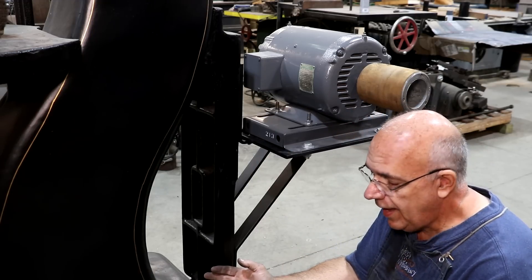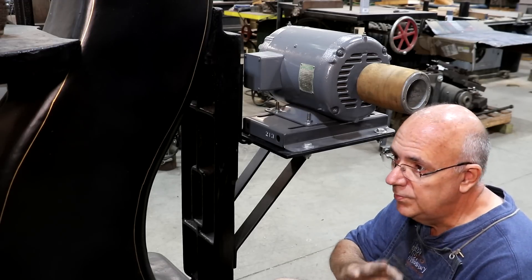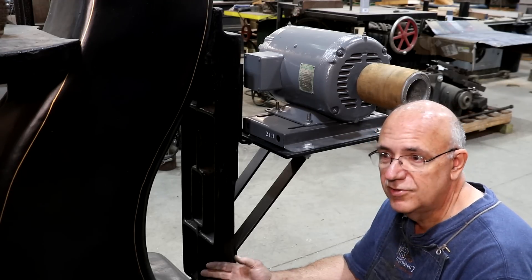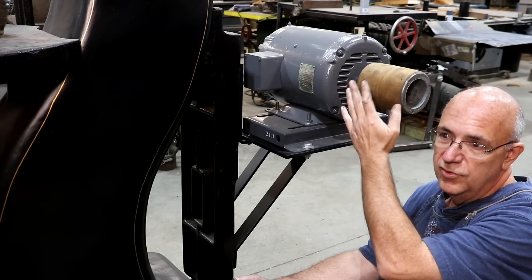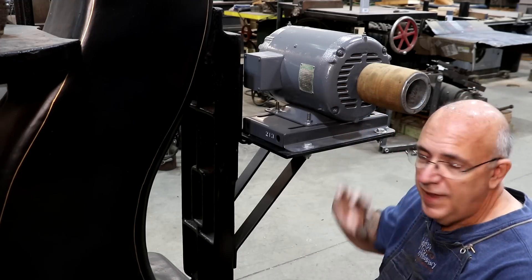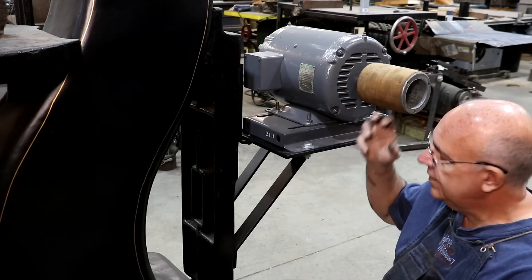To have a properly sized breaker for this, we would need to feed it with probably a 30-amp breaker. A 20-amp breaker would be too low because we need 22 amps. I don't think they make a 25-amp breaker, so probably a 30-amp breaker — but that's too many amps. If this motor gets in a bind or whatever, you could burn the motor up if it was provided 30 amps. So the motor starter is going to detect whenever it reaches however many amps that motor is rated for, and it will actually turn the switch off. That is to protect the motor.